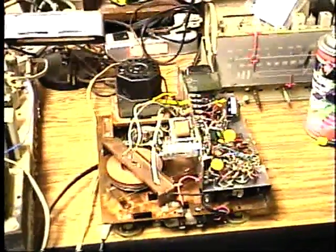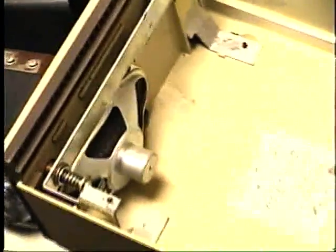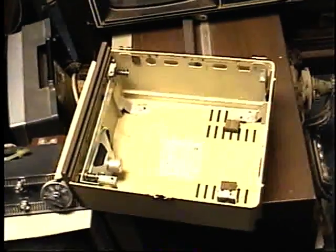It has a heavy-duty, well-constructed motor up here. Inside, you can see I put new capacitors in it — new electrolytics mounted on terminal strips, and some new mylar caps as well to replace the old paper capacitors. This is the interior of the sound tape machine case. It just has a little speaker in there.